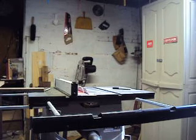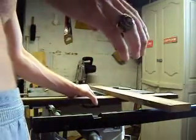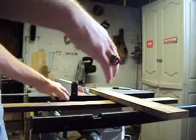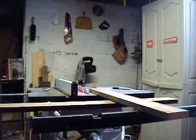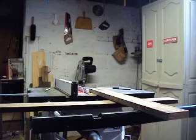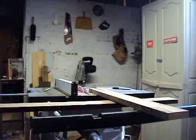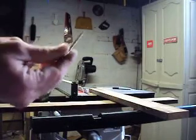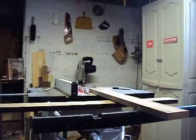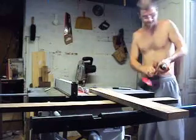It don't matter. One sec, let me get my drill. I gotta find my bit. Found my drill bit. Now this is softwood, it should countersink, so let me get some screws. And this should be on our way. Now I use 1.5 inch screws with a Phillips head.